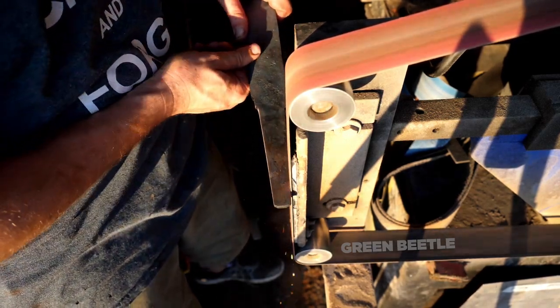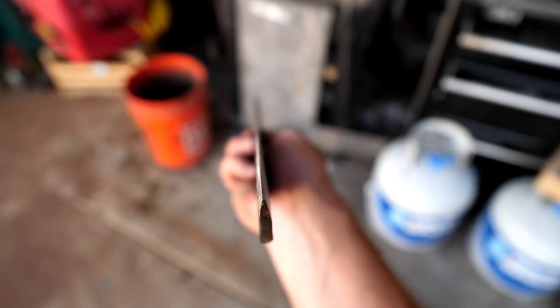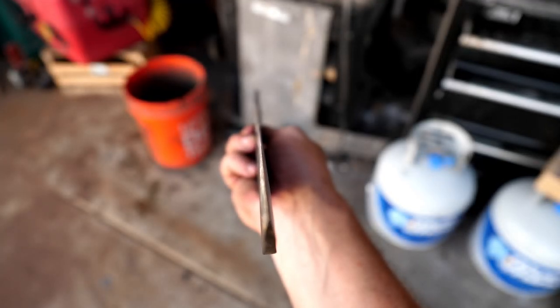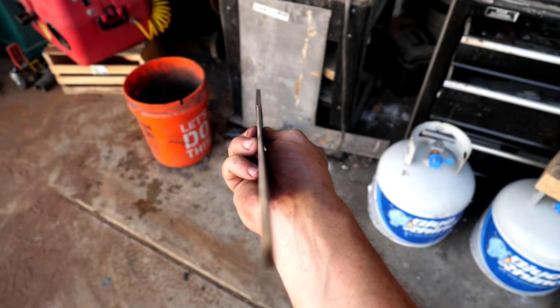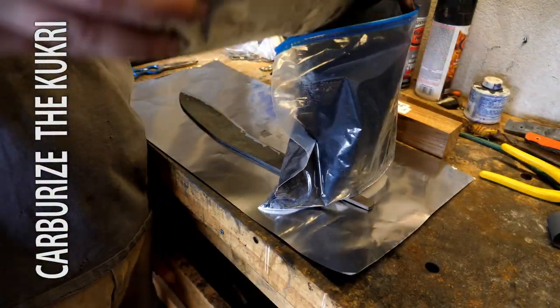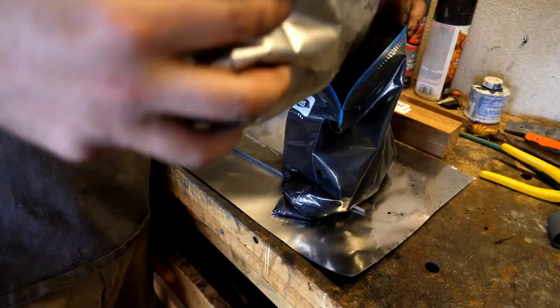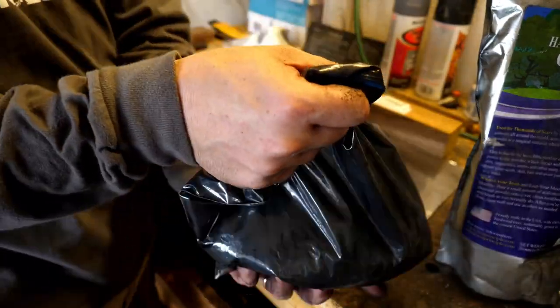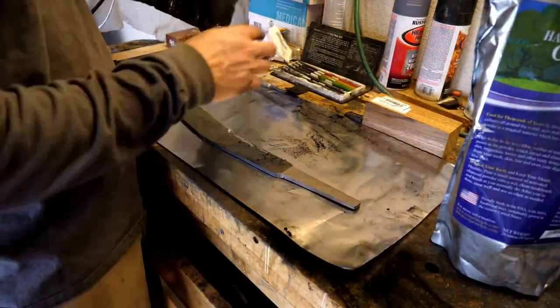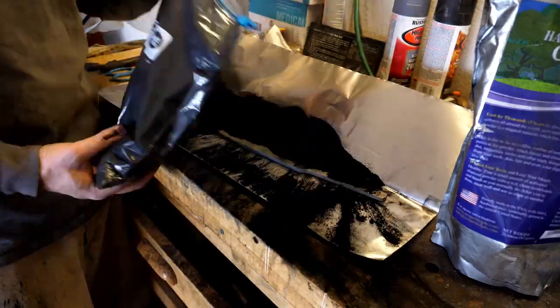After the grinding, I've taken quite a bit of care to keep the blade straight, and it has been ground down to about a millimeter or so in thickness to facilitate complete uptake of the carbon into the edge and so we can get full thickness hardening there. Our carburization powder is constituted from roughly 30 to 40 percent sodium carbonate — which is baking soda essentially heated in the oven for 30 to 45 minutes to 250 degrees — and the rest is charcoal powder.